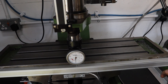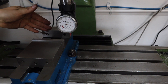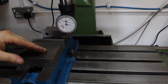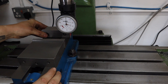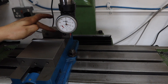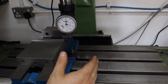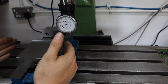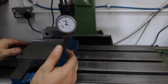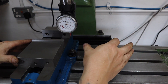The mill is ready to go once we've got good power in the workshop. The final thing left to do on the mill is to dial in the vice so the back fixed jaw is running parallel with the ways of the milling machine, because if we just bolt it down as is there's quite a lot of slop and the jaw won't be parallel. So I oil the bed and offset the vice over to the left to leave extra space for the turntable and dividing head. Then I use the fixed point method — bolt one side of the vice down fairly tight, leave the other side fairly loose, and give it a tap with a mallet to dial it in.